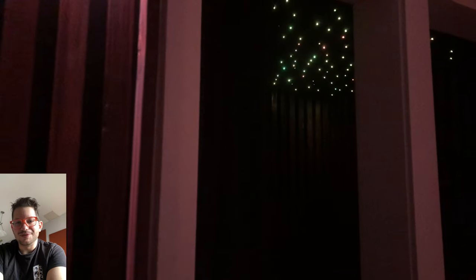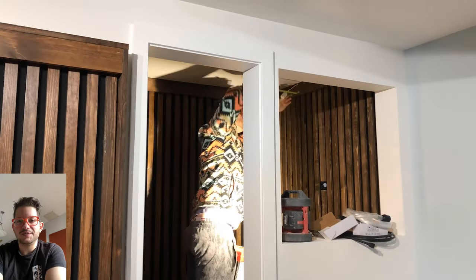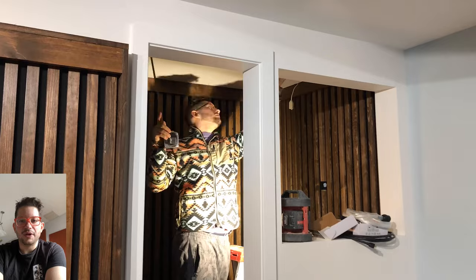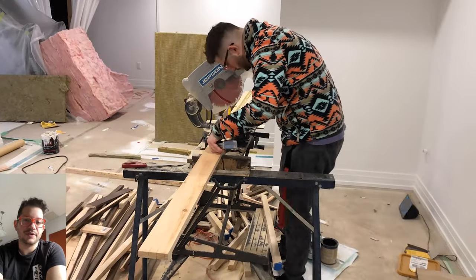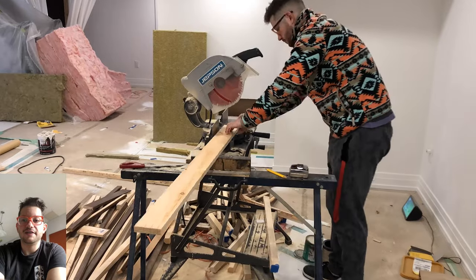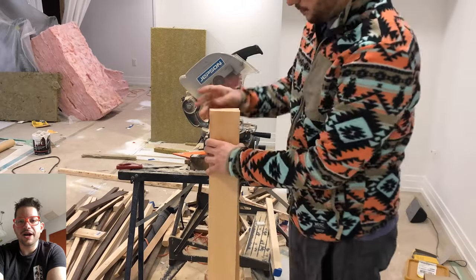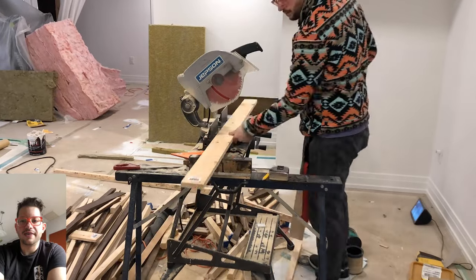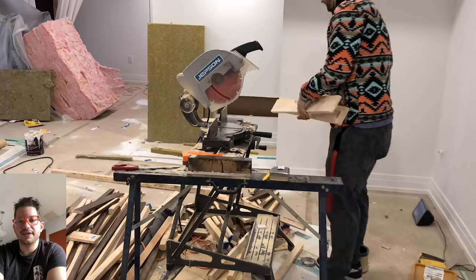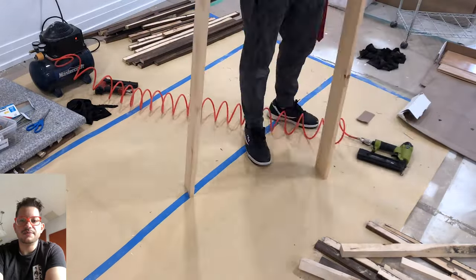The very first step to build this panel is figuring out how large of a frame we need to build. I'm going to measure out my spacing — we left about a three inch perimeter around the ceiling for hardware and to have a little bit of wiggle room when mounting the cloud. Our final size ended up being about four feet by three feet and we are using one by four lumber to build this frame. I'm marking out two lengths at four feet and two lengths at three feet, and once my lengths are cut I can nail them together.